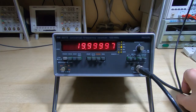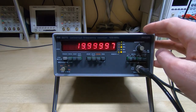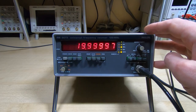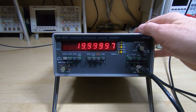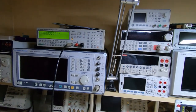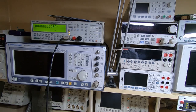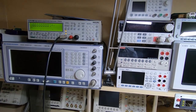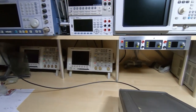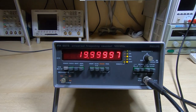It's reassembled and hooked up to a signal generator. I also have a piece of equipment in the lab that's been calibrated fairly recently, with its frequency output connected here. Moving the camera - you can see it's my PM6680, calibrated fairly recently, and this unit is almost dead on, just a very small fraction of a hertz out. This Philips has not been calibrated for the best part of 30 years, so that's extremely good.